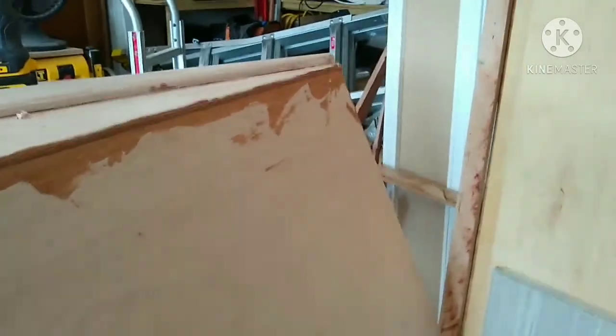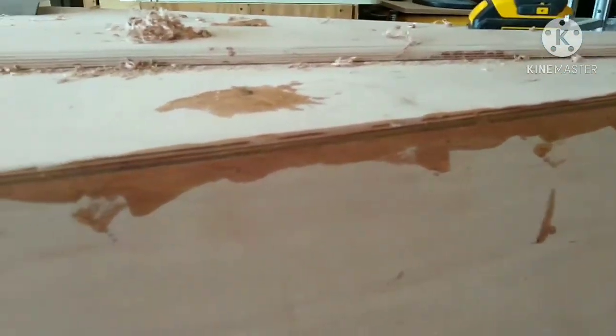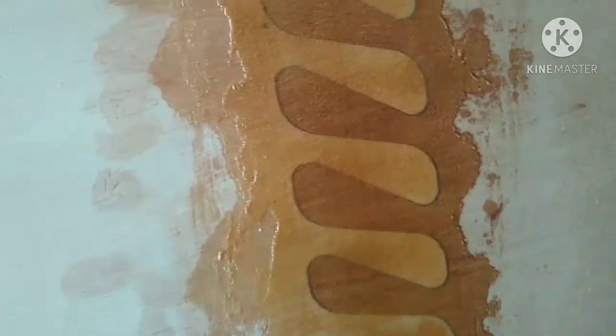Alright, I did a little bit to get these. There were small joints, maybe a millimeter, up to 2, that I filled. And then where the bulkheads go through the floor, I filled those holes. There's just 6 holes. And then at this puzzle joint here, I just put a little bit more thickened epoxy because it wasn't the best joint. So we'll sand that down, and when it gets covered with fiberglass, you won't see that it's been there.